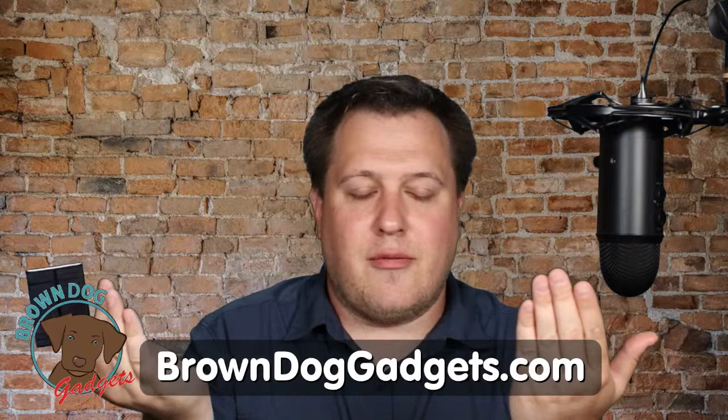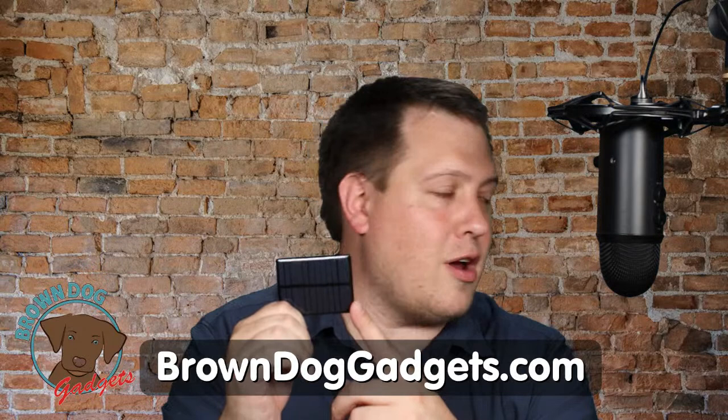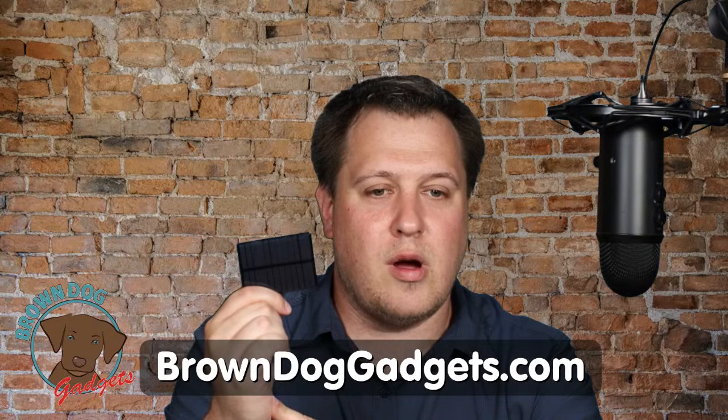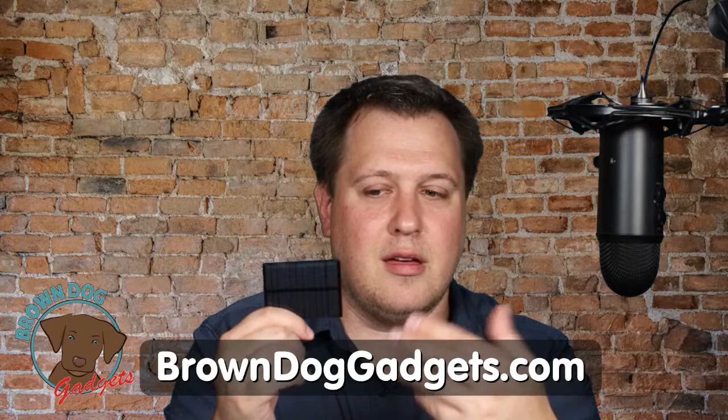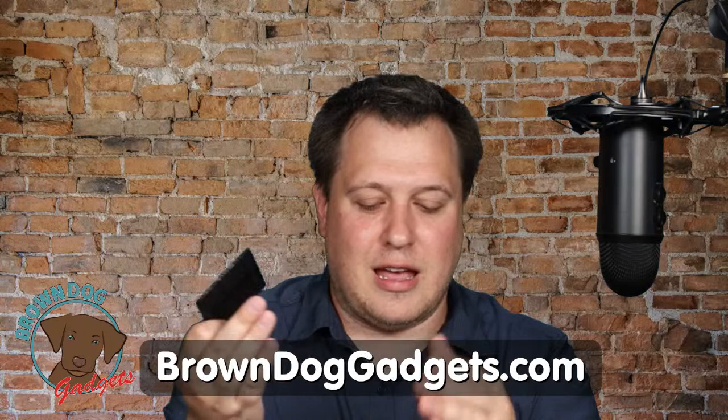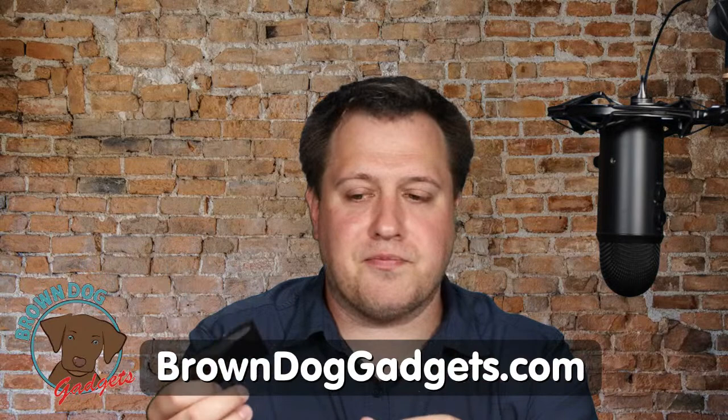It's been around for well over 100 years, how to make it work. It's just getting the efficiency and the price point to where it's actually useful. I think these are maybe like 15 to 18% efficient at converting solar energy. The newer ones are getting to 20 to 30. The higher you get, the more power you can generate per square inch. That's why folding solar panels for camping are so big, because you need a lot of physical real estate. A couple 8.5 by 11 sheets of paper worth of solar panels to generate enough for a cell phone, or at least reliably, which is a lot of physical real estate.